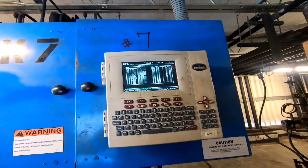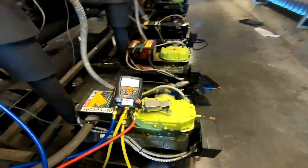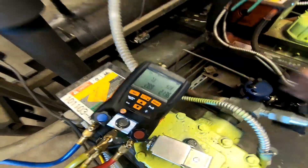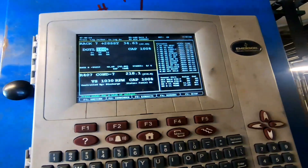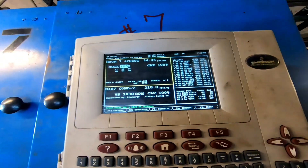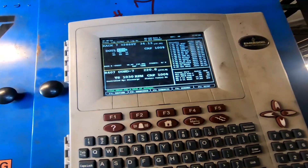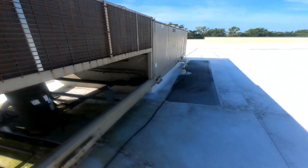Let's just let that time out. Checking the transducer: 31 on suction, 212 on discharge — making sure they're reading right. Getting 218 and 34, a little off. I'll offset to match things up, but if it's greater than 5 PSI just go ahead and replace the transducer.